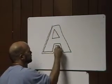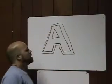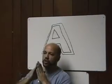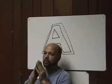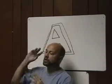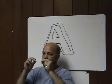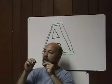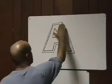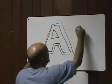The halo occurs because in order to get everything to print you have to have some amount of pressure - you can't just be touching the paper, there's some impression going on. Because the plate is resilient, it squeezes. The material doesn't just compress - it's incompressible like water, so it gets displaced. Some of the soft material of the plate actually prints.